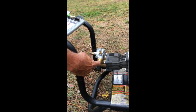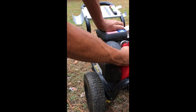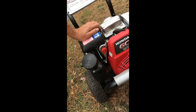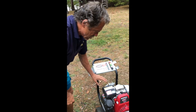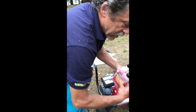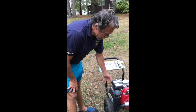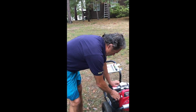This is where you put your handheld hose for spraying. There's the on, there's the off — so it's on. Take the choke, choke it and start it. Now I cleaned this all out yesterday — I ran it dry. So there's gas in the carburetor from yesterday. I put the Sta-bil in, and the reason I'm burning all the gas is in case there's something left in there.